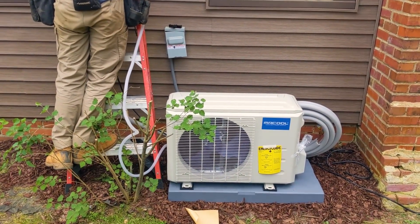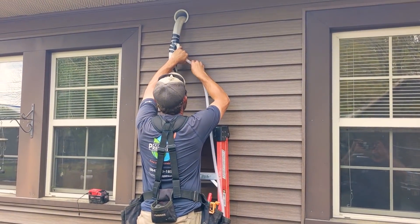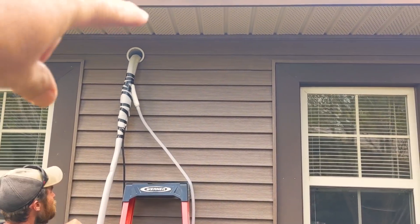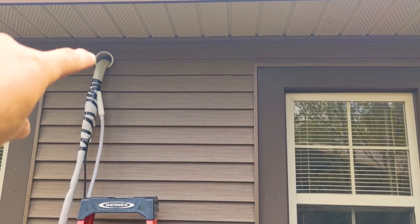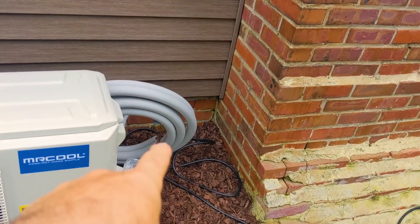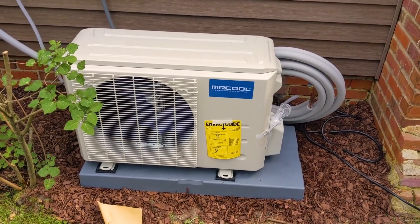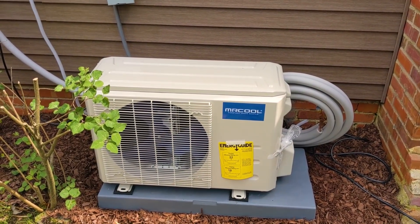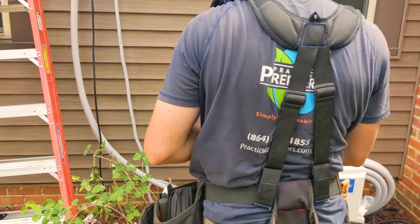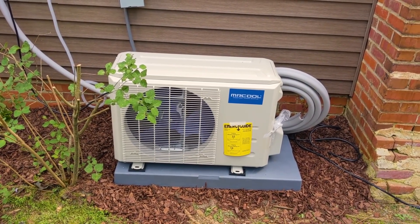Engineer 775 here on a hot day — summer's coming fast and we need to get air conditioners in, so we're using Mr. Cool to get the job done. Abraham and I are installing a 12K unit. We've already mounted the inside air handler and bored a 3.5-inch hole through the wall to bring the line set through. The beauty of this system is the pre-charged line set — no pulling a vacuum, no handling refrigerant. We're also excited because we just installed solar, so we're going to run this unit off the solar system as a critical load for heating and cooling when the grid is down.